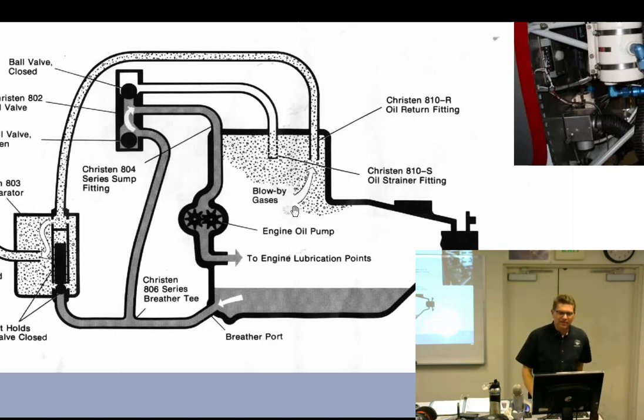And because it's got a fuel injection system, fuel injection doesn't know which way is up anyway, so it'll just fly all day. The only thing you have to worry about now is the fuel tank. You have to have a weighted line in it that will flop down and follow the fuel, and a vent system on the tanks, or just small enough holes that it just leaks out slowly.